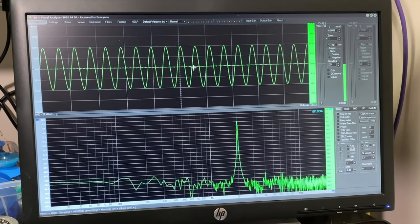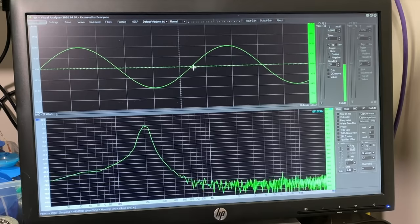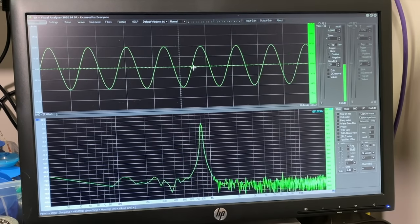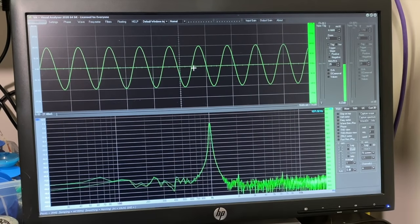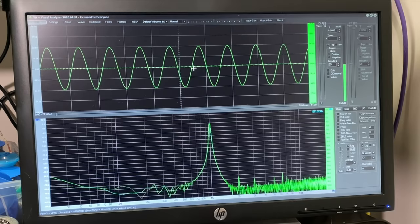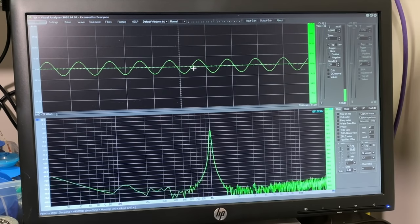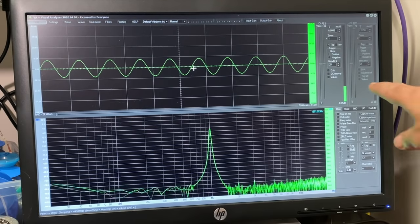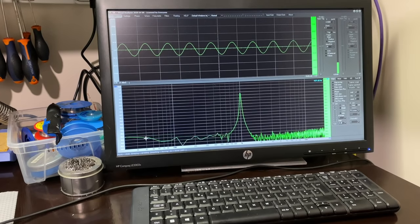I can look for artifacts — if I've got an amplifier or something else, I can see harmonics over here. If I go too high on the input, I can just switch to times 10 on the scope probe. At 5 volts input with the scope selector at times 10, I can go further — I've got 20 volts peak to peak and this thing is still way below where it should be. The noise floor gets a little bit noisier at high attenuation, but not by much. So as far as I'm concerned, this thing is usable, it's good, and I'm going to be using it.